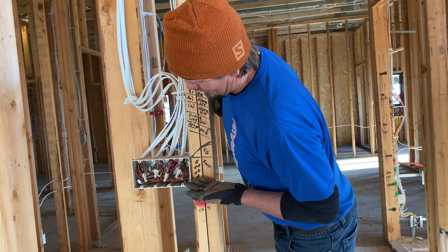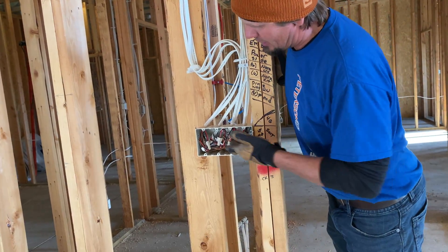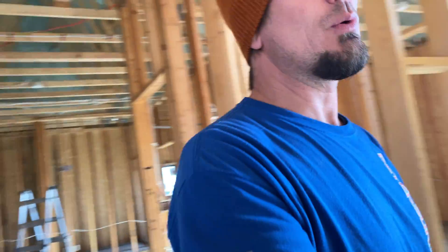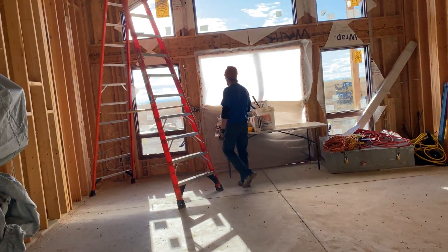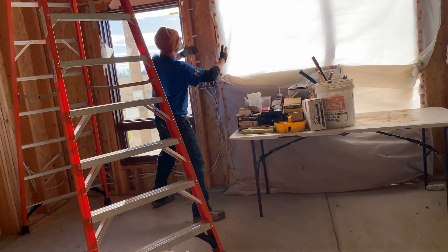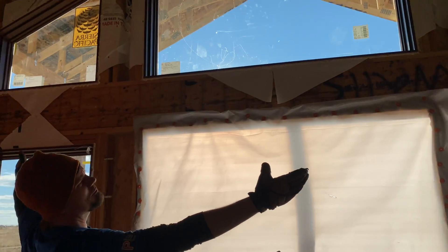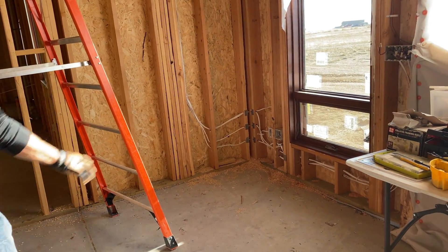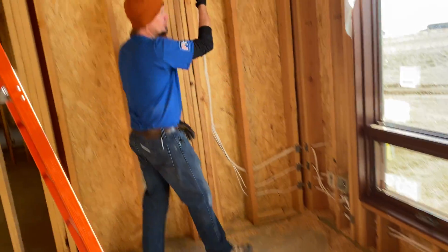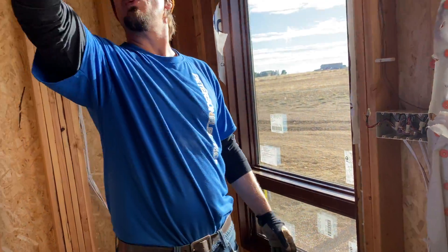Coming in here, I showed my wife and kids the first time — this is basically a four-way box here, and it's jumping around, but the power and switch light come out of here. So everywhere I went was a dead-end circuit. It still worked as a good three-way or four-way, but it dead-ended with only three wires because the reason we do that is walls like this. Those architects just love assuming electricians don't have to follow code. All of this wood — we literally had to drill everything and put as minimal circuits as possible coming up. I put the doorbell transformer there just so it's closer to the door so I don't have to deal with going into the furnace. The code doesn't care about that, neither does my inspector.